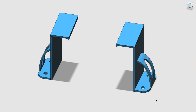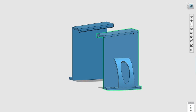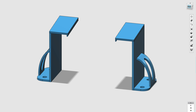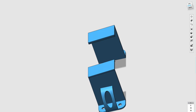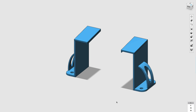Here are the upper two side brackets for the mixer. You can see the angle that these wound up on — this is why I did all that angular measurement — so it could run across the angle and create the little lip that goes across the mixer, and as you can see they match. This also has a support piece to make sure it's got a little bit of additional support. I cut a hole in this as well using the same technique; in this case the purpose wasn't to provide screw path, since there's plenty of screw path this way, but again for the ability to tie-wrap cords. I didn't really expect to have cords running up here, but since I was designing it anyway I thought it was good to have that as a feature.